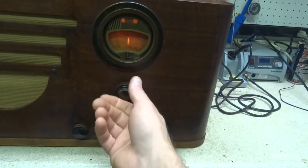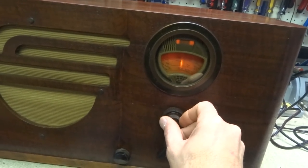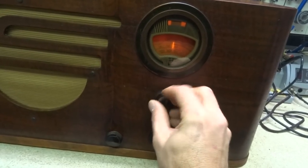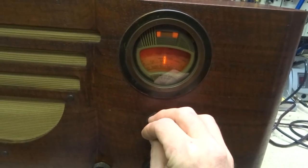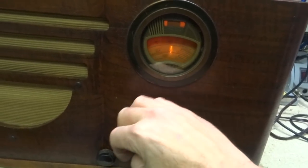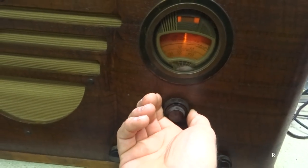Looks good on the broadcast band. We're not going to pick up much on this middle band because it's during the daytime and these lower bands don't propagate very well. But we are picking up a little 40 meter FT8 signals right there, so tells me it's working. Not going to make these band scans too long. People complain about them being too long.